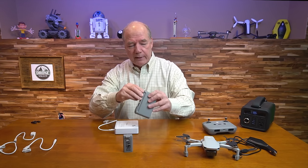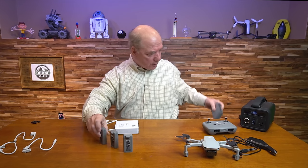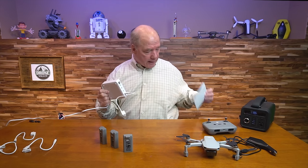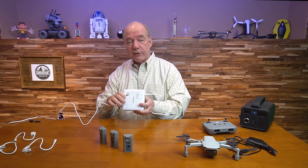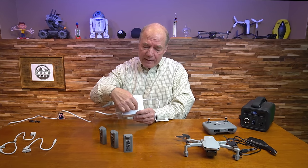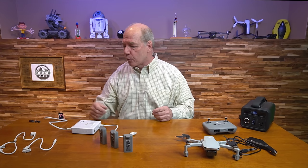Let me show you how to do that. We get the controller out of the way and remove the batteries from the hub. So I've got the AC cord — it comes with an AC cord and an instruction manual. You plug the charger in and it starts a power-on self-test internally, checking to make sure all the electronics and circuitry are working fine. If it passes that test, all the lights come on green, which means no batteries are connected and the charger is working.